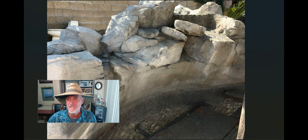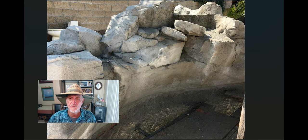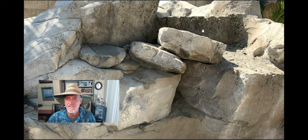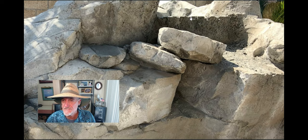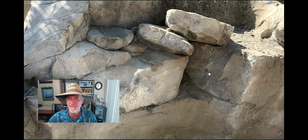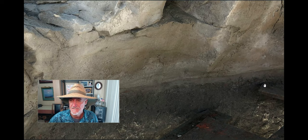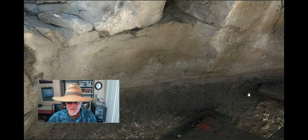Here's a picture of the front of the feature — the scaffold is pulled back enough to see what's happening. There are those big rock portions; I don't often see guys putting rocks in there, as that creates places for water to go behind. Obviously all this has been waterproofed prior to the texture coat. The starting pond is up at the top. I'm not sure if those little notches at the top get a more finished treatment, but they break up the waterfall so it doesn't look fake. Folks love long sheeting effects in waterfalls, but if you get a sharp edge you still get a better drop-off.